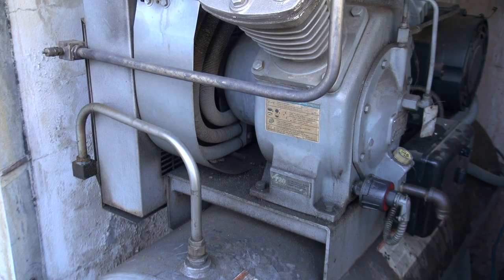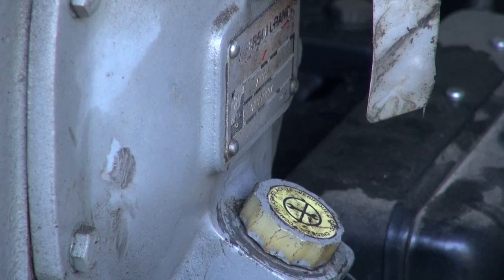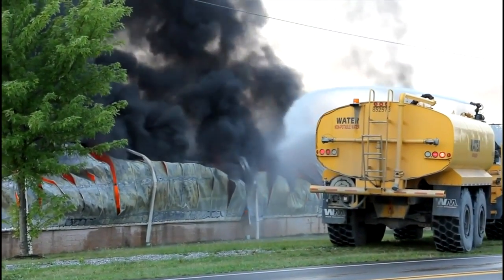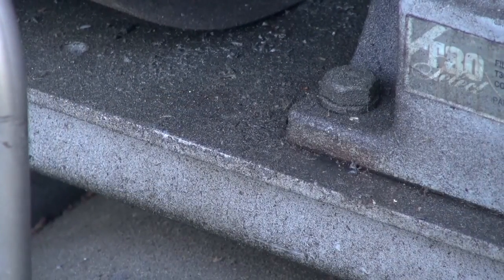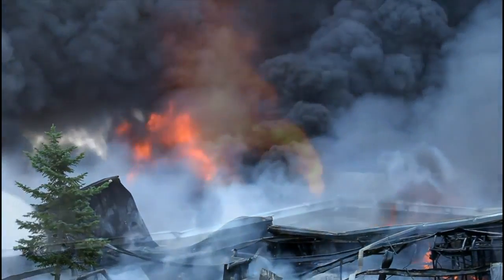Industrial surfaces just like this. As you can see, most of the surfaces are covered with a layer of combustible dust, oil, and other residues, all of which could immediately ignite if they came in contact with a spark, arc, or flash. In fact, just the static electricity in the air can be enough to ignite some combustible dusts if they become airborne under the right conditions.